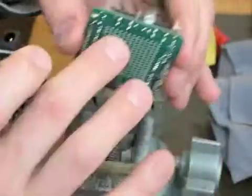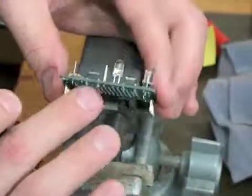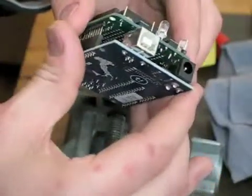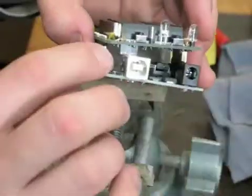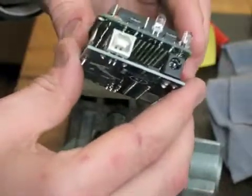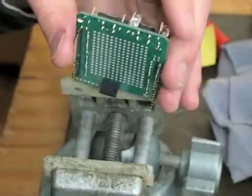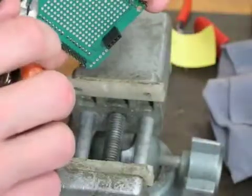We noted that the pins on this front switch, labeled S2, can potentially interfere with the top of the USB case. We've done two things in tandem to prevent any sort of short circuits. First, short clip the leads on the switch itself.